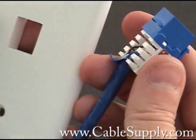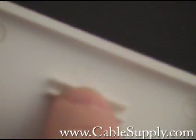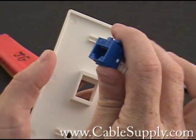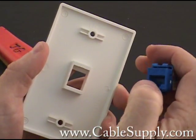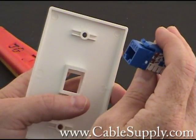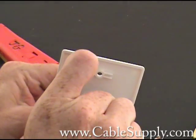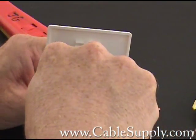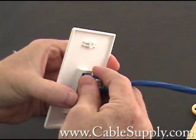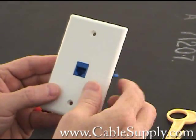What I'm going to do is add it to the keystone faceplate. On these faceplates — I don't know if you can view that — but it actually says 'up.' On jacks, you always want to put the eight conductors in their eight positions. You want to keep them up so dust doesn't settle on them after sitting in the wall for years. You start at the bottom and it snaps in. It gives you a nice clean appearance — it will not come out. The way to get them out, of course, is with a screwdriver bending it. That goes on the wall; put your labels right there.